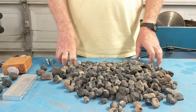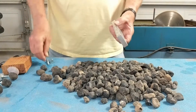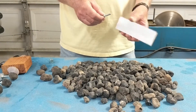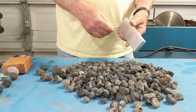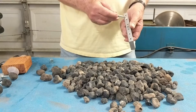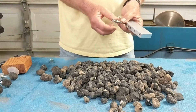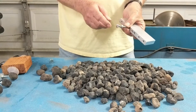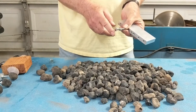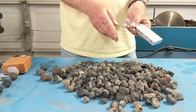You have to have a method to hold them in the vise on your slab saw, so I'm going to use this fixture my son made for me. It's a piece of aluminum flat bar, five-eighths by two inch, and it's six inches long. He drilled and tapped several holes along the six-inch part for quarter-twenty bolts. The bolt I'm going to use is a garage door bolt — it's got a nice flat head on it, which is better than a carriage bolt, which has a rounded head.